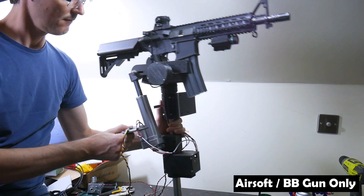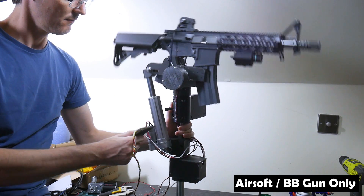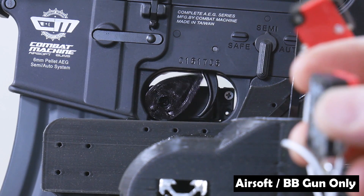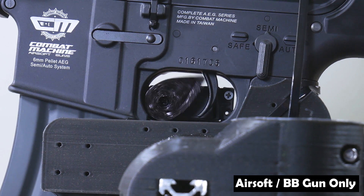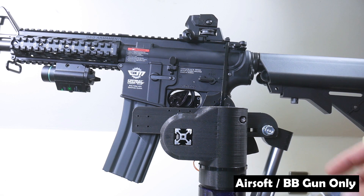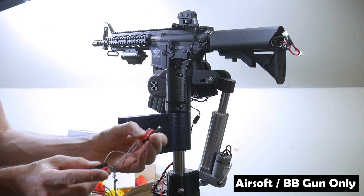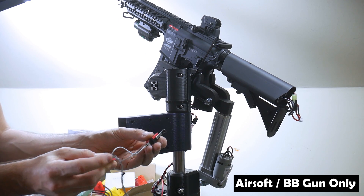I'm still reading the difference between the two inertial measurement units, so if the whole suit tips backwards and forwards nothing happens until the pilot moves his head. I've also implemented a cam to pull the trigger, connected to a micro switch, and a servo turns and pulls the trigger. The gun has various modes including single shot or auto fire, and there's also a mode that disables the trigger and flips the gun up with another switch, putting it into safe mode.